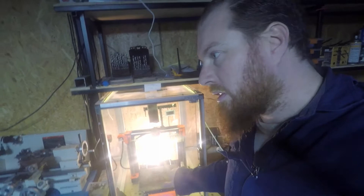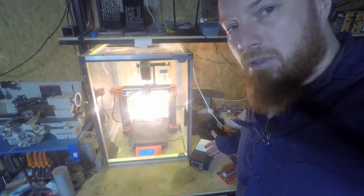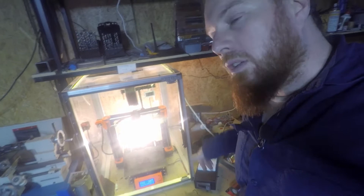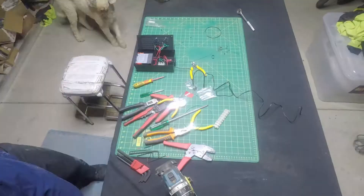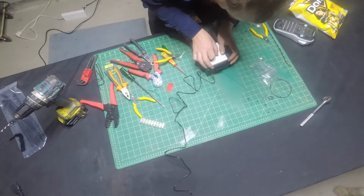For now I just want to get this print going, and maybe while I start doing this print I'll put this STC-1000 module together — that just needs to basically be assembled, and then I can plug in the light into the heater. For the cooler output, I'm thinking I can set that up so there's an alarm plugged into that — like a siren running on a 12 volt plug pack. Here's the final stage of the STC-1000 unit being assembled, and I'm going to set that to 50 degrees Celsius, and then we're ready to go.